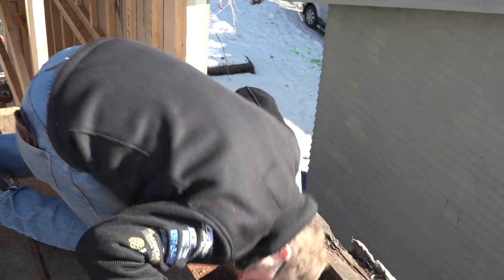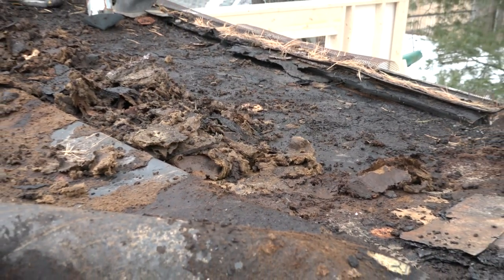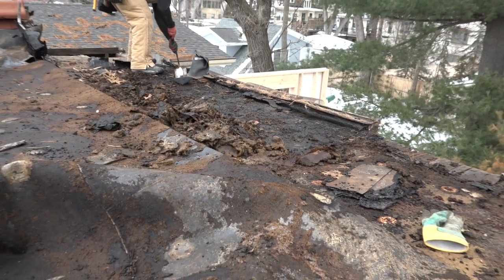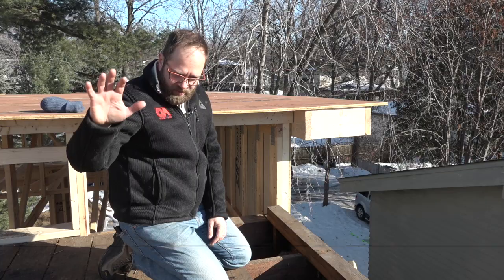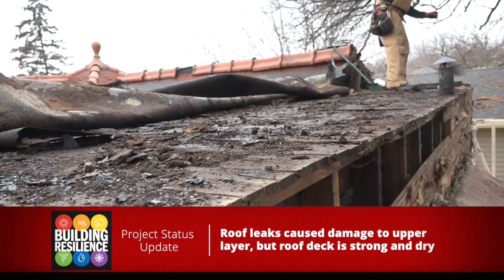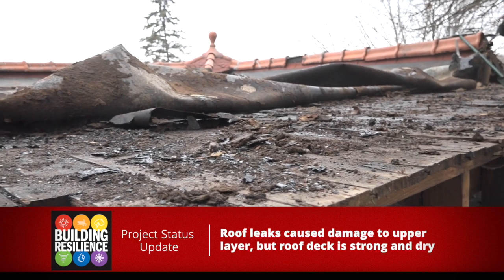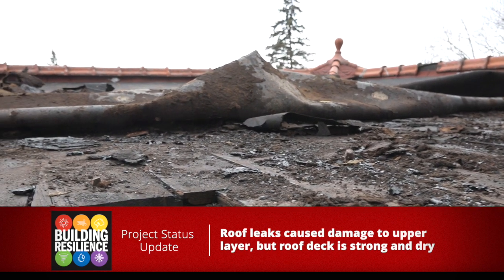That's pretty cool. What's not so cool is that they found a layer of soggy spongy muck under the roof covering. Turns out there were some hidden leaks that were isolated but not victimless. The rubber roof that was up here had some holes in it, the buffalo board was soaked, but the tar paper that was mopped under here kept all this really pretty dry, brittle, and old, which is ultimately a great thing.